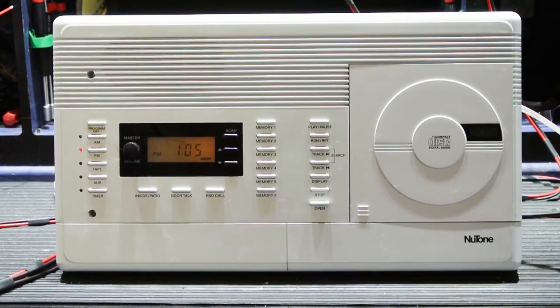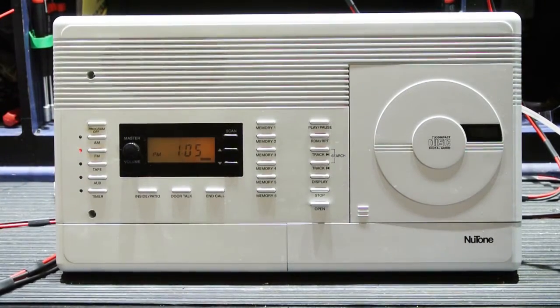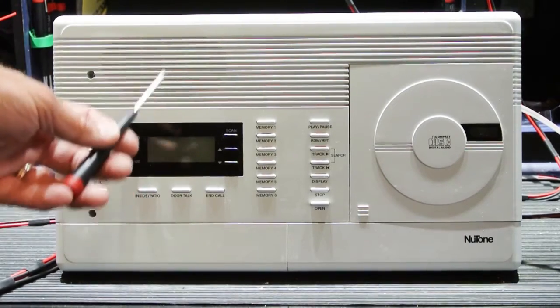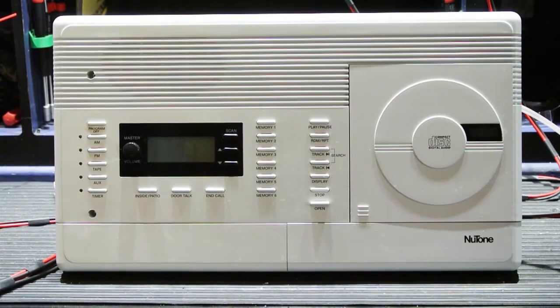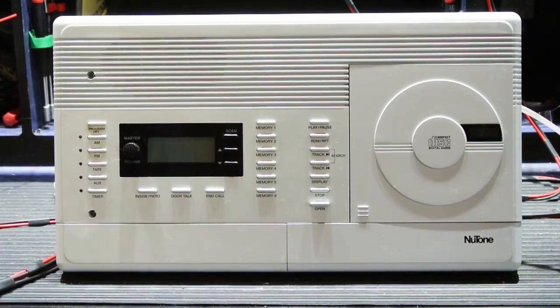It seems as if this time the audio isn't going to come back on — but there it is. It was still locked into intercom mode, which is the clicking following the popping. So I think we found the culprit. Thanks to Robert being very observant, we have a real-time, real-life example of the failure mode — common failure mode number one — of a failing voltage regulator on an IMA 4406. Now I'm going to repair this unit and we'll check it again once we're done.